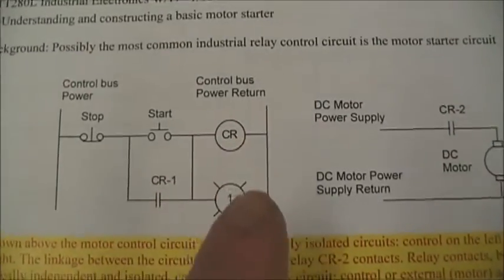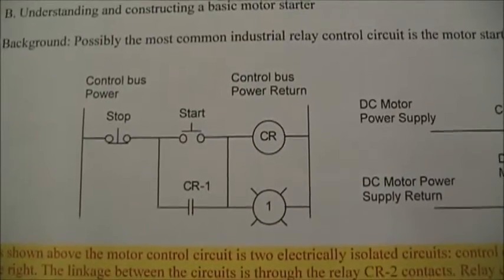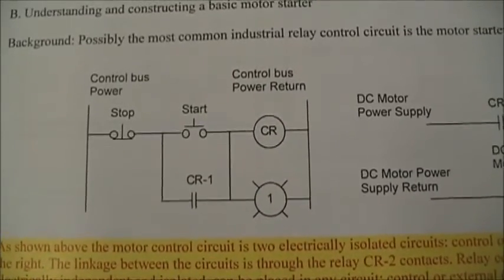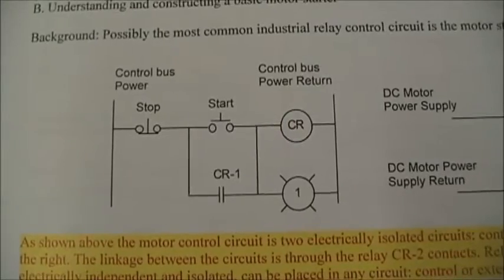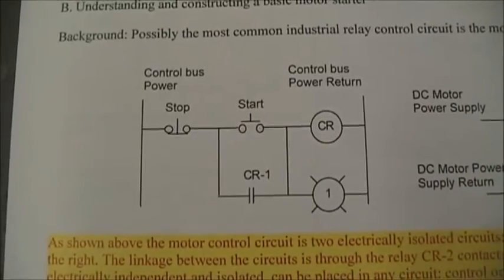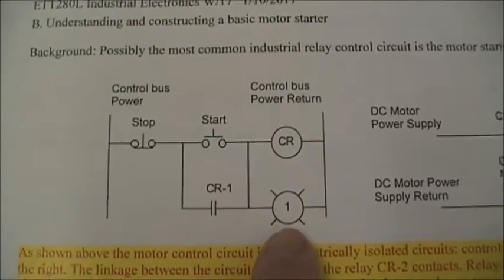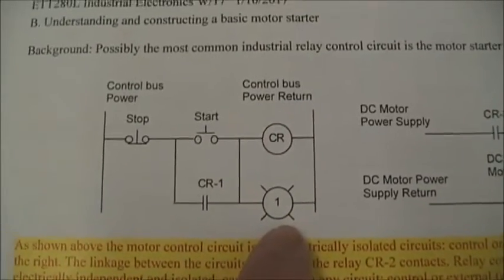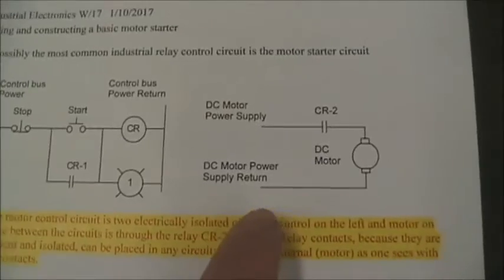You need to make sure the coil voltage and the pilot light are matched — that's usually the supply voltage. So if we have a 12-volt relay, we need a 12-volt pilot light. In these laboratories, we use a resistor-LED combination for our pilot lights. If you use a red LED, that's a little less than 2 volts when turned on. Pick an appropriate current rating — 10 milliamps is good enough. Most modern LEDs can be seen easily on 5 milliamps, but 10 is a good easy number.